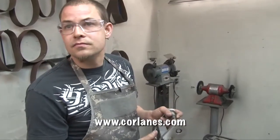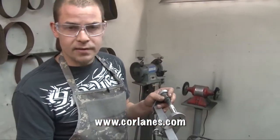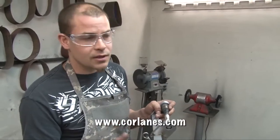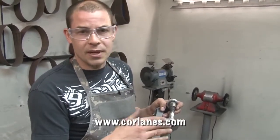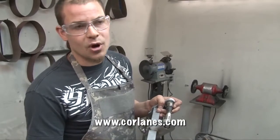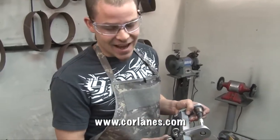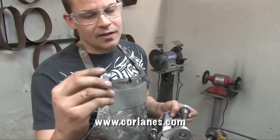So what if at any point I want to take my muzzle brake off — then what? Then all you do is remove it like any other threaded object. We provide a muzzle brake wrench which goes through two sets of the holes so you have a nice clean edge. Pop your brake loose and remove it. We can provide a cap for your muzzle brake — there are situations where some guide outfitters don't like muzzle brakes if they're really close to you. They'll ask you to bring a muzzle brake cap and shoot without a muzzle brake, just for their own hearing so they can communicate better. Basically a thread protector — you want to protect your threads, because if you drag them up and down off the floorboards of the truck you might damage an edge, and then when you go to put your brake back on it won't go on smoothly. This is a typical example of a muzzle brake cap — it's the same dimensions as the barrel, so you just thread that on and you're safe.